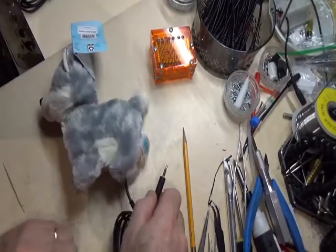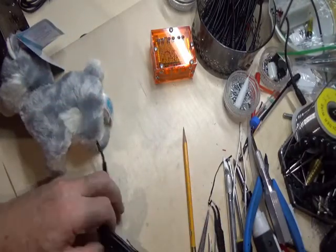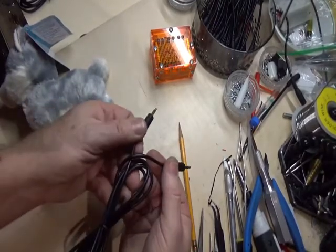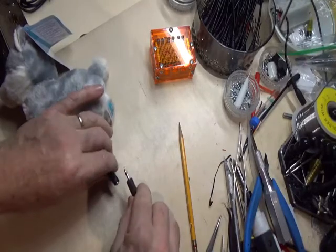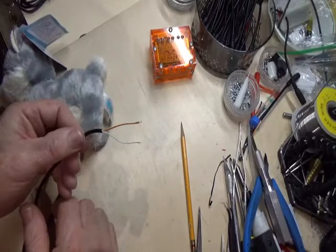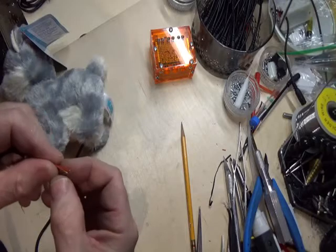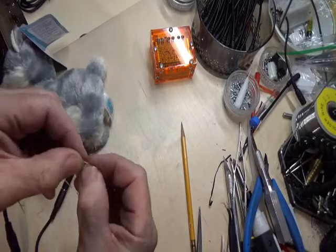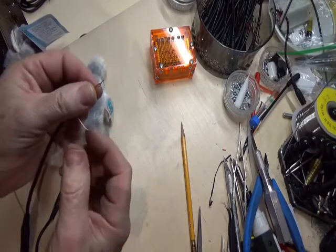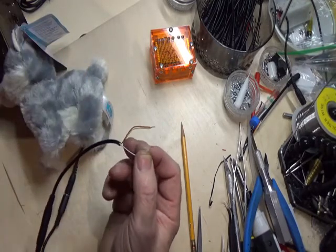So that's a quick way to do a home test — get a toy that works, that you already know works with a switch. Make up a male-to-male connector for testing purposes only, so that you can test this cable as you get it ready. We already know on this one — twist yellow and red together again, attach the white to it — it activates and deactivates the toy.